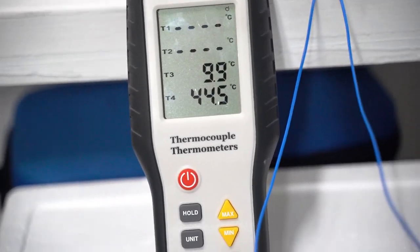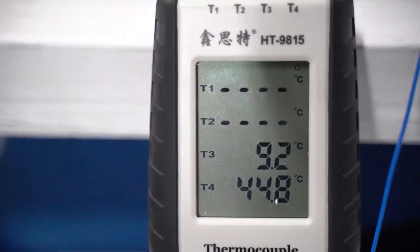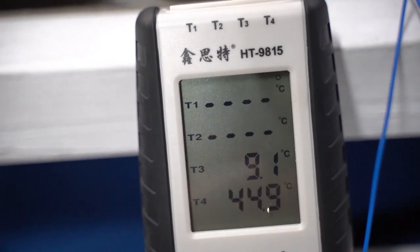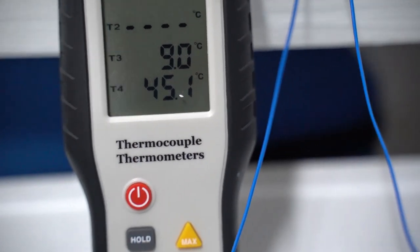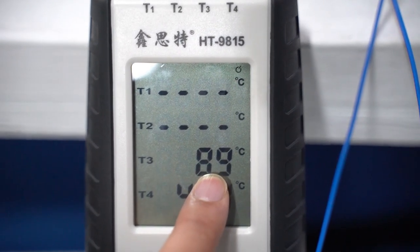For the last part of our experiment, we have fully charged the battery again — it's at 42.75 volts, which is just about right for a 36 volt battery. We have plugged in the thermal heater and T3, the probe, is connected to just a normal plastic wrap surface of the battery. The other probe is connected to the heating element which is showing 45 degrees — that is perfect. We are going to wait for this to come down to close to zero, just like the previous experiment.